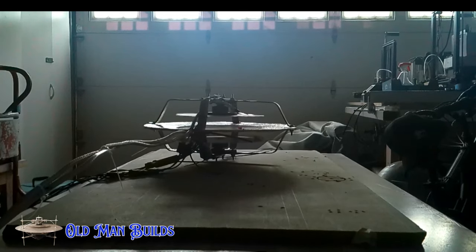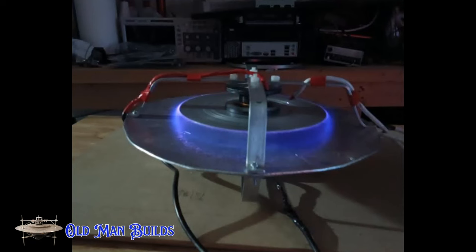Speaking of high voltage, this is the first high voltage test that I did — it was a complete disaster. All the metal bolts I put in there started to spark over, so I would never get the voltage on the plate. I had to switch everything to nylon bolts. But once I got everything working together, man was it a sight to see. You turn off the lights at night and you get this beautiful plasma glow right around the plate. Every single time it went around, it looked like it started a brand new piece of plasma. It was gorgeous. Once in a while it would spark over, so you had to adjust the distance on your plate — but this thing looked beautiful.